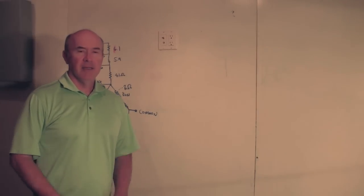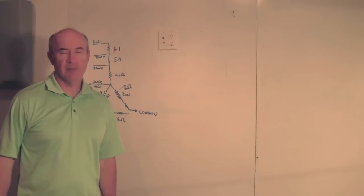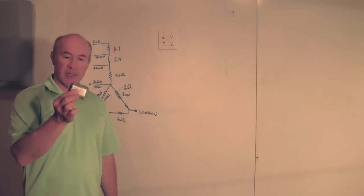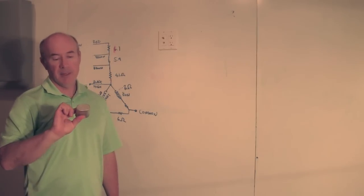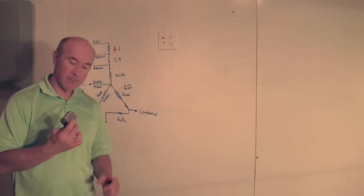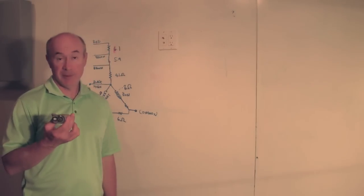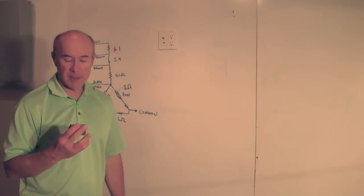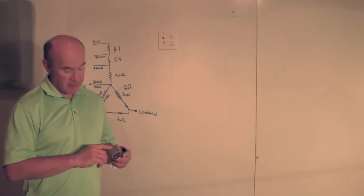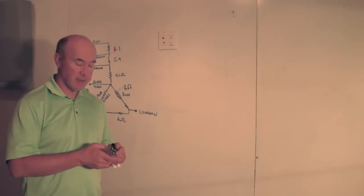So I got the blower motor installed. Everything works. One thing that I would do differently this time, this is the RUN capacitor. I bought a replacement for about $6. The price varies maybe due to the quality where they're manufactured. There were some that were $3, there were some that were $38, but basically it says the capacitance on the side and the voltage. So this was a 5 microfarad 370 volt AC.